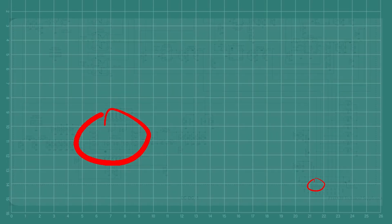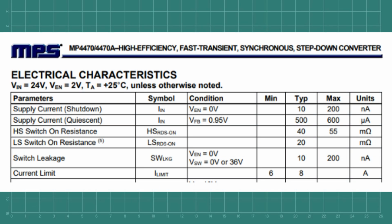According to the datasheet, this regulator is capable of supplying a minimum of a 6 amp current before being limited. It is to be noted that some impedance will be encountered, such as track resistance, resistance of inductor windings and ferrite material, although this is likely to be a maximum of a few hundred milliohms.